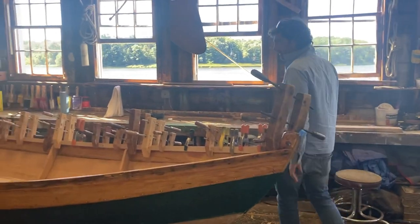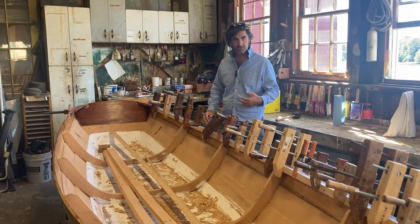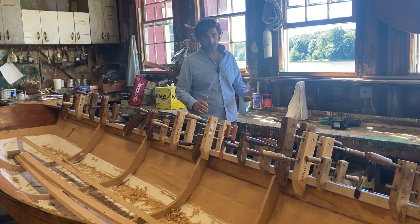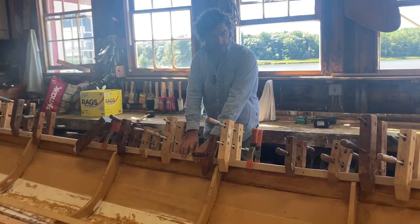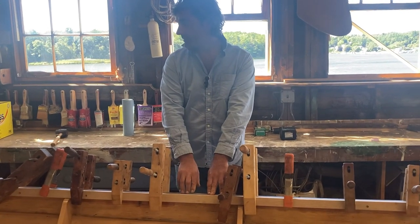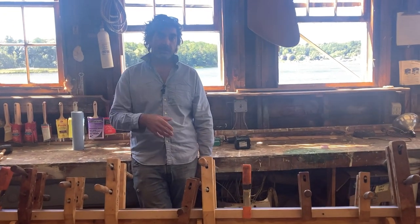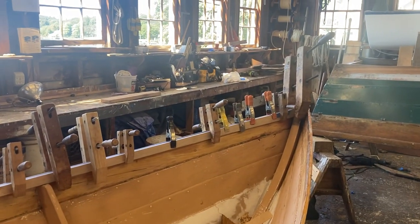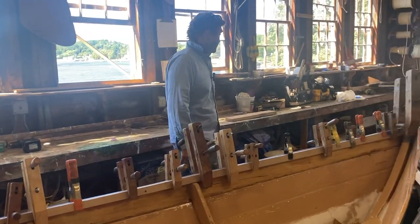And then here we have another Mohonk boat. This is one of the older ones that I brought back from the hotel that we are restoring. One of the things about the Lowells and the shop is that they were constantly trying to improve, and that's what we're trying to do here. The way these boats were built, the rail structure was pretty, but they had a lot of ins and outs. So what we've done is simplified it into a more solid rail, which makes it easier for the hotel employees — because they maintain these boats in the winter — to keep them looking good. It doesn't do them or us any good if these boats don't look great for their hotel customers. We're trying to improve upon this structure to make it easier for them, which we've done here, and that's going to be the new way going forward with these boats.